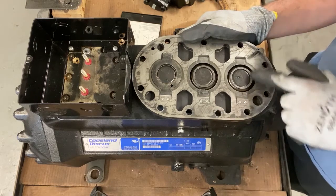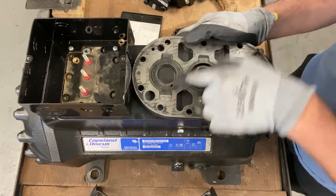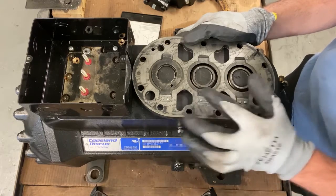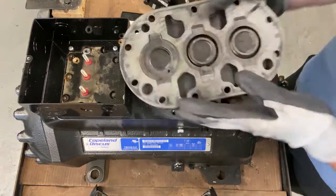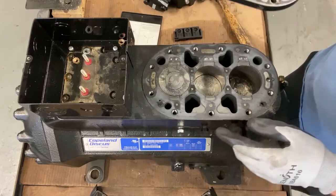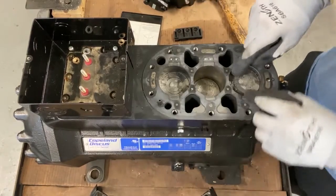So we see this suction damage out here, a piece of it's inside here, the discus puck. The pucks are still good, and you see here, this one's damaged here. So after taking a slug, I'm assuming this one took the first slug and broke, and then caused the rest of them, maybe this one broke at the same time. All this black stuff up here is pieces of the suction reed, okay? And when we take a look under here, let's see if we can pump this, we can see parts in here.